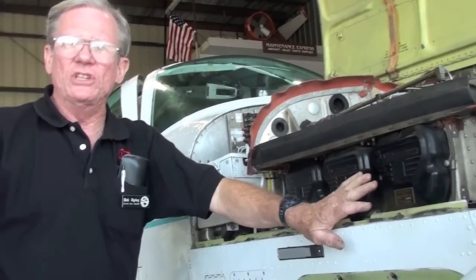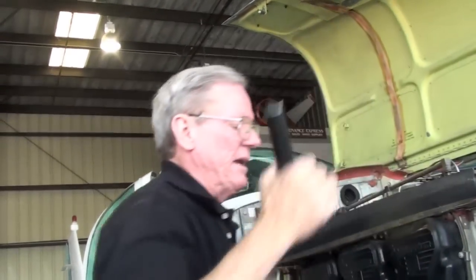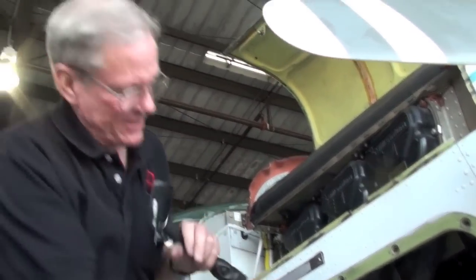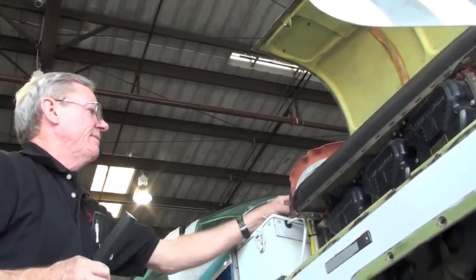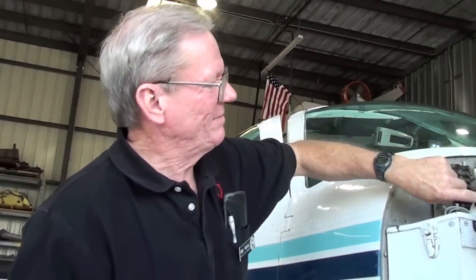You know, the UB engine. Isn't this the UB? Yes, I think so, 20 UB. It's the only one that uses this slip joint with the extra flange on the end. Most of them are just a solid slip joint, and they seal up a little better. But this extra flange allows it to move a little bit. You'll see a little bit of blow by. Okay, your battery cooling duct here is about collapsed. See it?